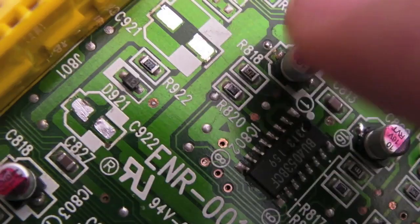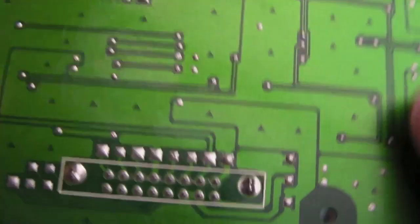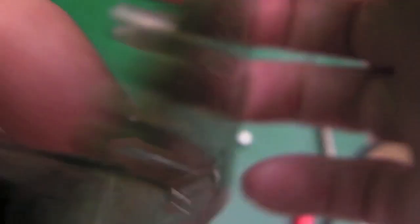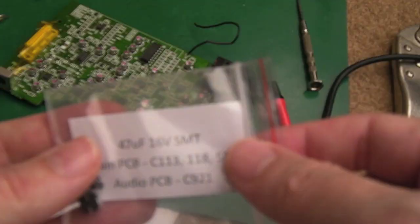The pads are looking good and they go into really thick traces, like on the power rails. I've cleaned around these components with a fiberglass pen. I need to do further work around these things as I remove the caps. I was using quite high airflow and it blew off a couple of resistors. The nice thing is you've got two channels — left and right — with identical sets of components on each side, so I can use one channel as a reference for the other. I'll just reduce the airflow a little bit so I don't blow things around — that could have been a catastrophe.